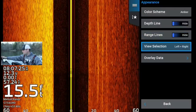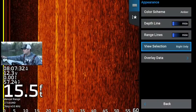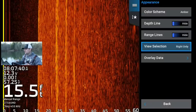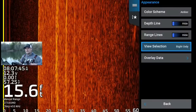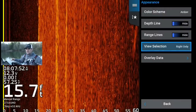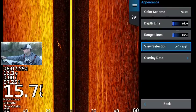You can change your view selection to left and right. If you were scanning docks, you'd want to put it on the least interference side. If your transducer is mounted on your starboard side — the right side — you'd want to scan docks on that starboard side, because then the signal's not getting interfered with by the lower unit. But if I'm just scanning deep water at 15, 20, 30 feet like I am today, I'm not really worried about it, and I'll scan both left and right because I'm looking for trees.